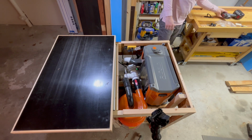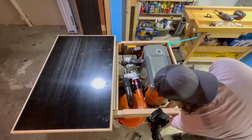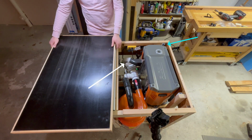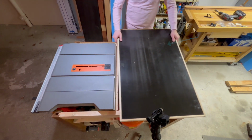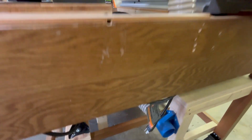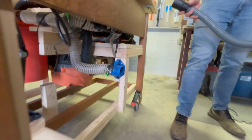Also, notice how the planer is mounted tight to the far side of the frame here. I had to move it there after the fact to get clearance for the dust chute on the planer against all my vacuum lines and my dust separator. And then I later went back and added a third blast gate running to the side where I have an auxiliary vacuum port.